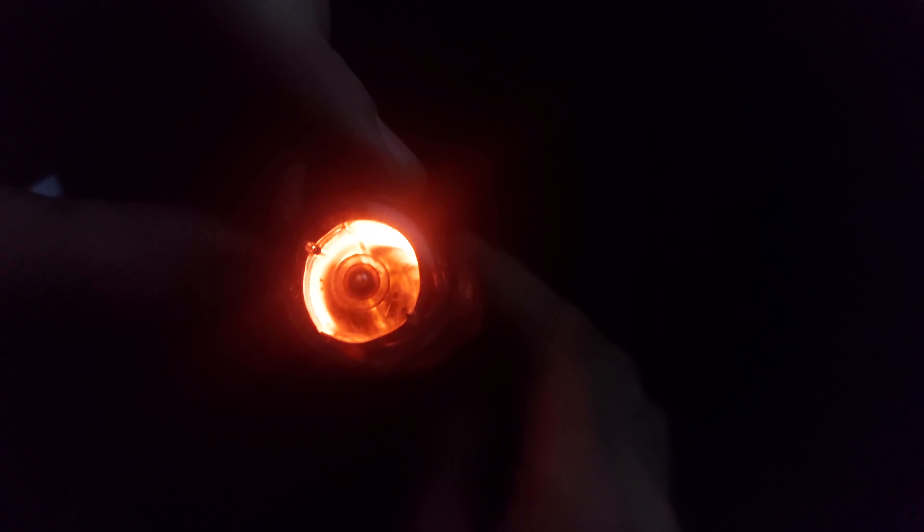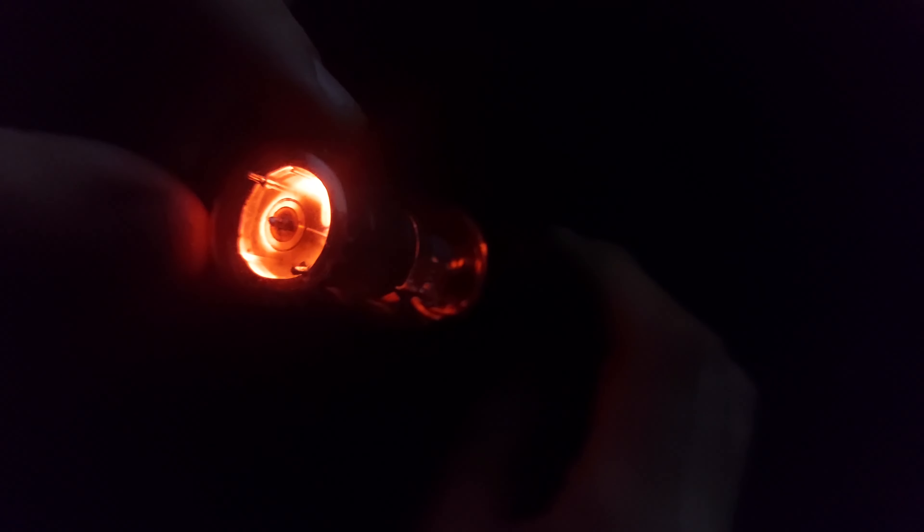It's pulling around almost 2mA at 300V to do this. A cloud of electrons boils off, gets attracted, and then gets projected onto that inner cone in there, which has a phosphor on it.